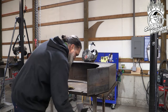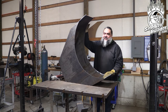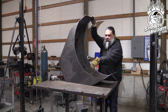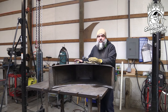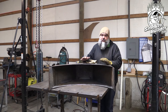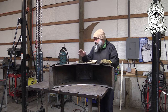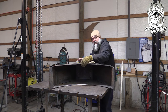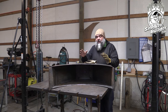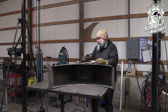That tack did it. The piece is getting heavy — will need help moving it. We tackle the opposite side edge. Once both sides are fit up and tacked, we weld the perimeter, but first we tack in a stiffener between the two sides using 2x2 eighth-wall tubing. This keeps things from shifting shape during welding as the heat expands and contracts the metal. The stiffener stays in until the piece is welded and installed on the tank, then we remove it from inside.